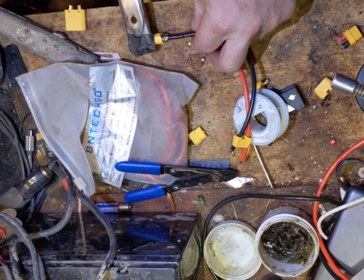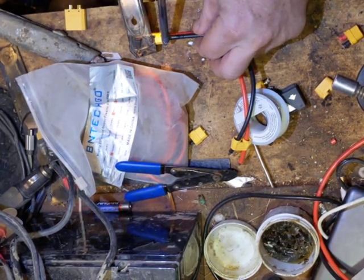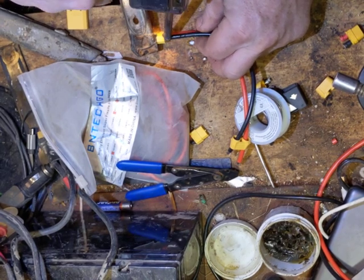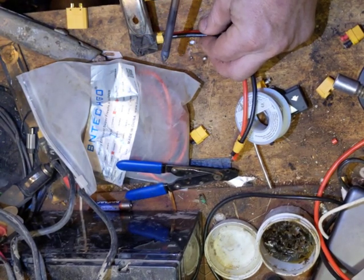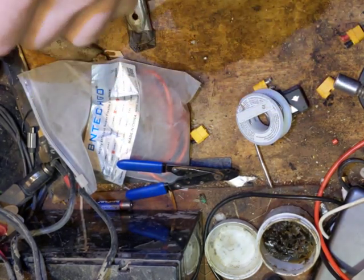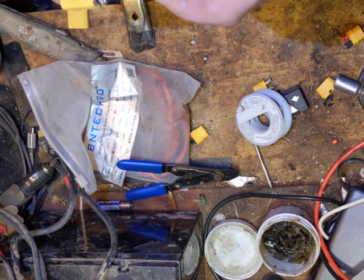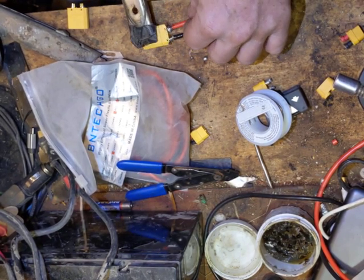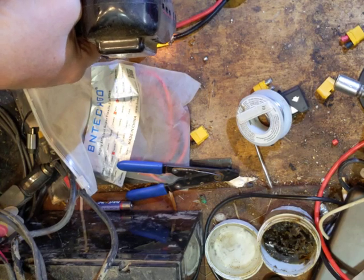You can do this with the clip too — just be careful it doesn't spring around on you. Just shake your soldering iron and it'll knock off the extra solder, so you can use it like a desoldering iron. You can also use a desoldering bulb. You can start to smell the plastic on that tool — it has a very particular scent. So if you're overheating the tool you'll start to smell plastic coming off of it — and I don't want to get too much of that. Always work with good ventilation. That's how you know you're overheating the tip or the gun.